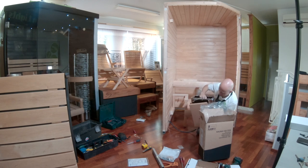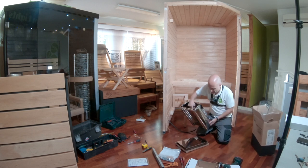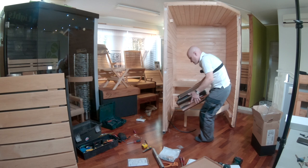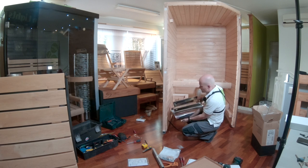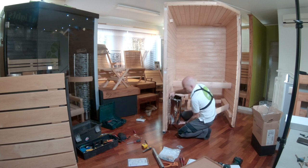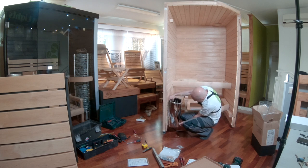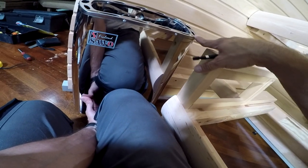and there's a back plate. Be careful not to scratch anything with that. And hold it against the wall. We have the electrical power, the power cables coming in through there. And it's coming from the wall. Now, there basically should be 15 centimeters below the heater. But I'm gonna check also in relation to this heater guard. So it's about the same level, basically. It should be a little bit higher, but I'm gonna just put it really pretty close.